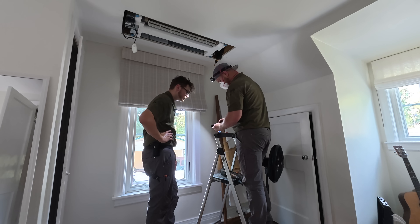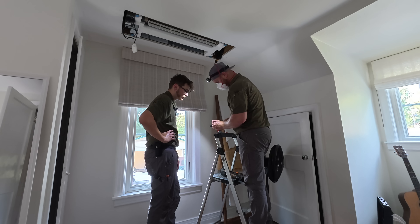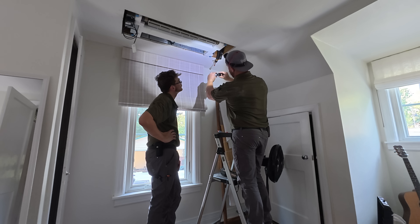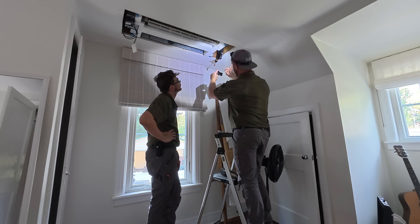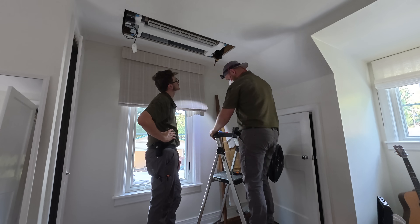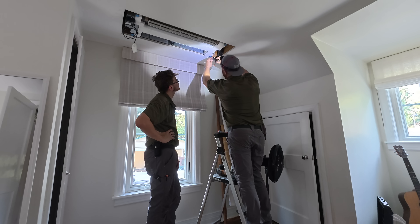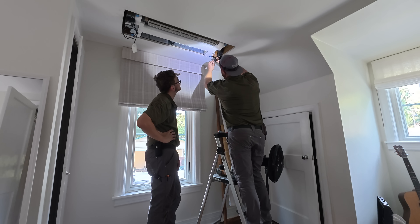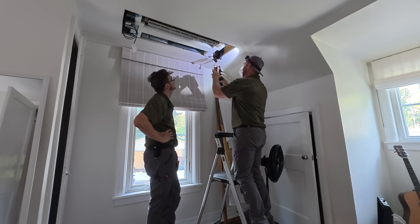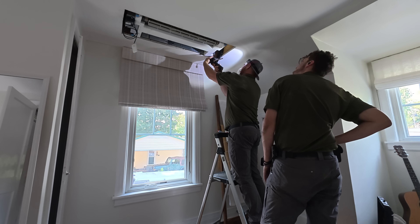All the different sizes depending on your copper size. This is your guide, your stopper, so you don't push the copper in too far. You always want the opening side of the jaw facing you because that's how the tool slides in. Always have your nut on first. You slide that and wiggle it until the copper hits it and you know you've got the proper depth. Just be careful when you're putting it on to not move it.